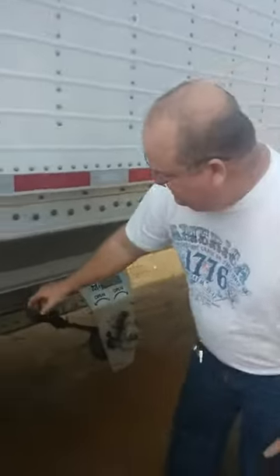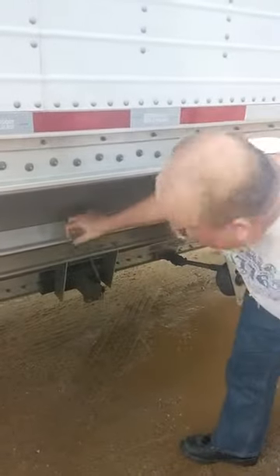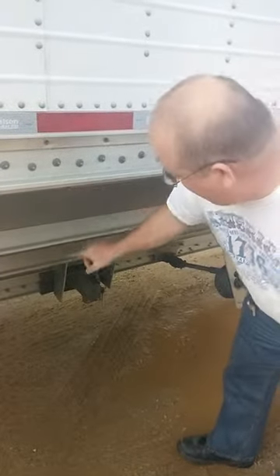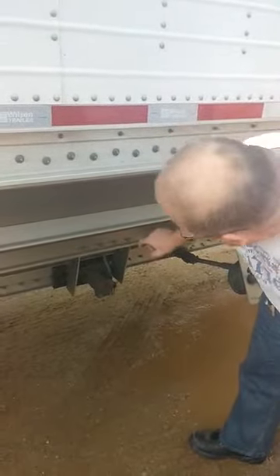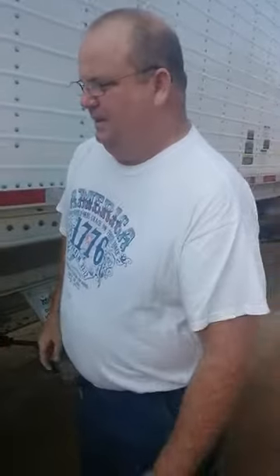When you hit on these rails, don't hit the hopper itself — hit right in along here with a hammer. Use a dead blow hammer; don't use steel on aluminum, as that will obviously tear up the aluminum. I'll get the hand crank out here.